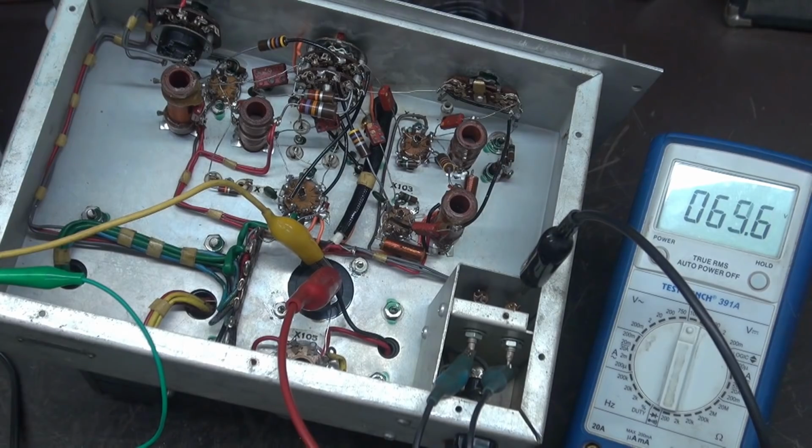See the voltage ramping up. Now remember, this time we're under load. So whatever we end up with will be our usable DC voltage. Okay, so there's 50. Remember, it's a 25 watt load. It's a 25 watt resistor, so it could start getting hot. Right, here we go. Bringing it up. Pulling about half an amp. Remember, we're really loading this thing up. There's my voltage.